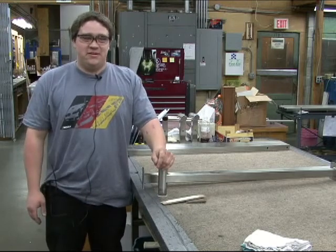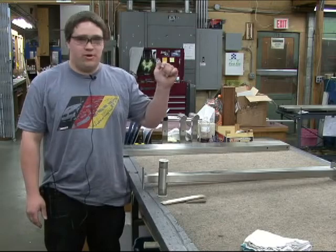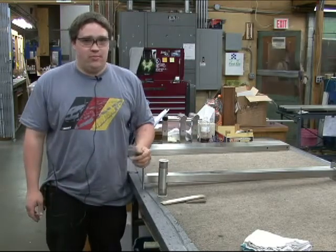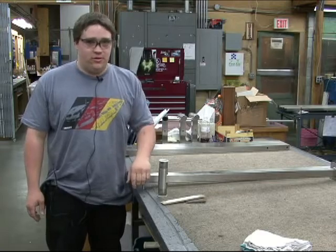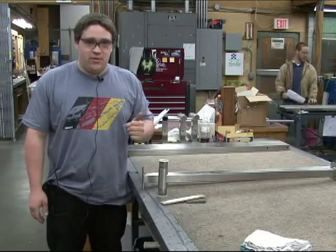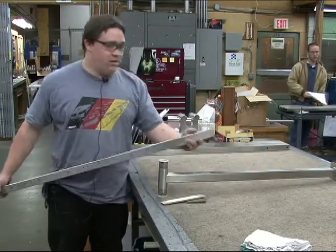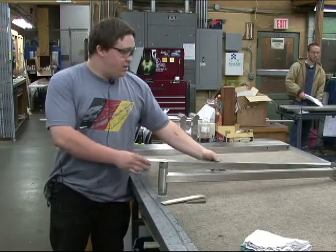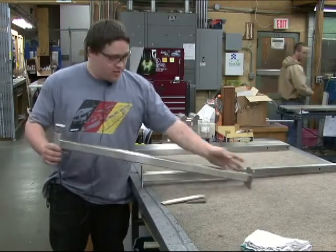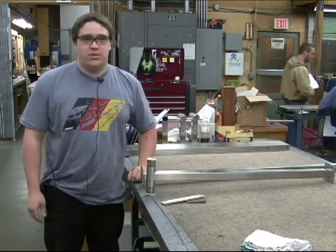Hi, I'm Ryan. The first thing that we do from detailing is we'll bring them over to cutting. We'll cut the posts all down to length, and we'll load them up into the CNC to get all their holes drilled into them. And we'll bring them off to welding. At welding, we'll weld on the two-hole top, and we'll weld on the base cap. And different kinds of posts too. We'll weld on a base plate or a round top, depending on what you request.